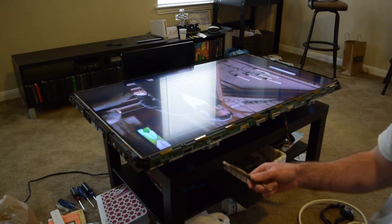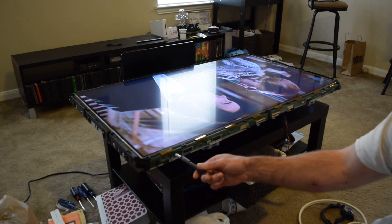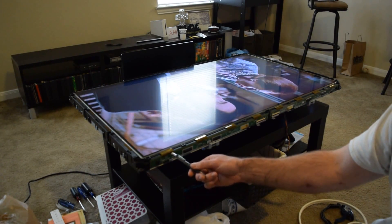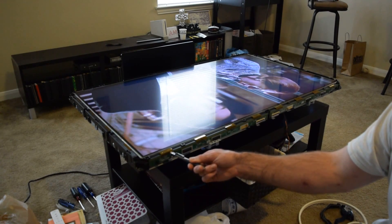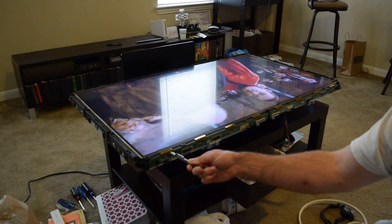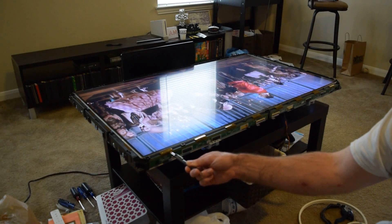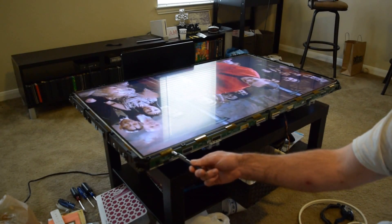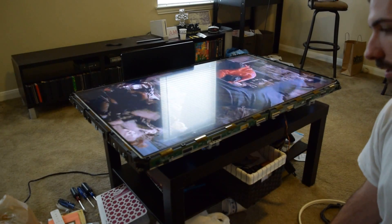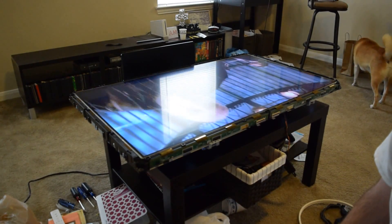The solution: this cable is starting to delaminate and some of the wires are not making good contact with the board. By applying gentle pressure we can essentially fix this problem, eliminate the intermittent issue, and restore good contact by applying mechanical pressure.